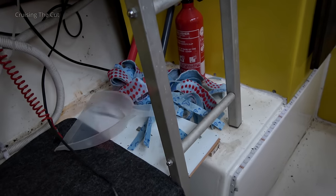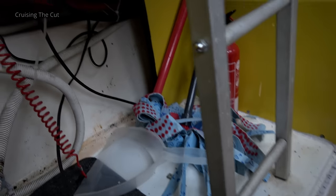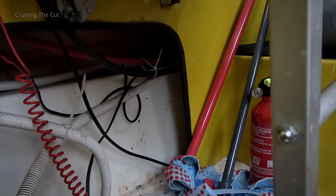This one I said must come from the old batteries - I've pulled it through and it disappears up to the back. The upshot is I think I'm doing a fair job of pulling out the old wiring that should have been removed when it was truncated, which will clear things up. Getting to grips with what wiring there is in this boat - there really isn't a lot. You've got the horn, the interior lights, the exterior lights, that's about it. Very simple. But I don't like all the things dangling off other things secured with gaffer tape, so I'll have a session on that towards the end of the refit.